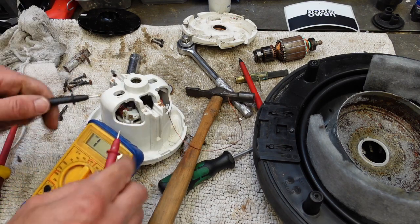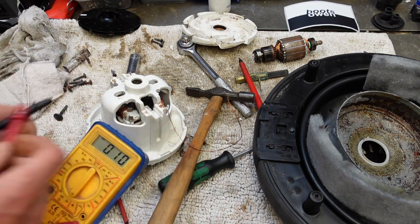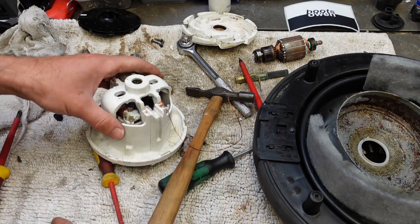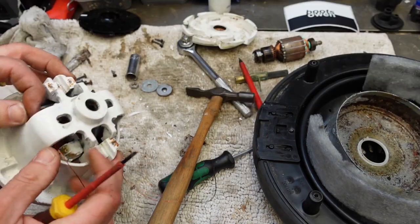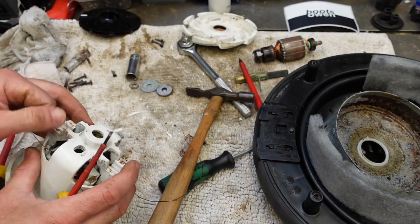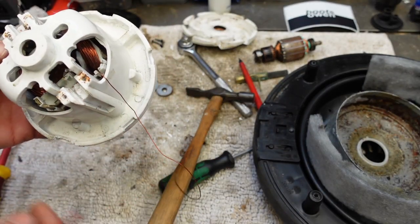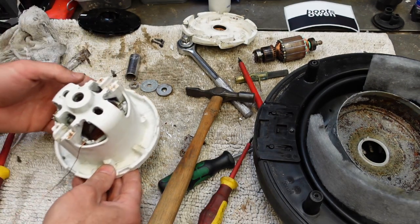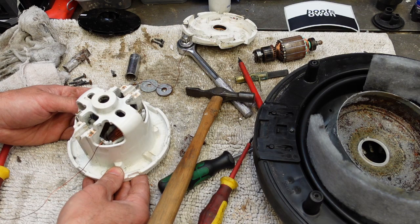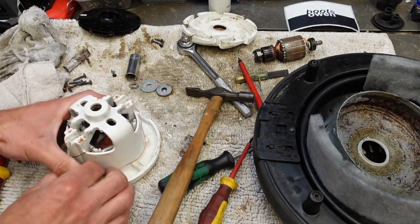Then bring it back up over here. I wonder if I could have done this in situ - I don't know if I could with the rotor in place. Just bring that wire up and have it hanging out for now. Like that. And then I'll do likewise over here. A heat shield or an over-temp sensor - something like that. But it's given me resistance, so it's probably not burnt out. So that means that something else failed before it failed.